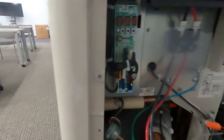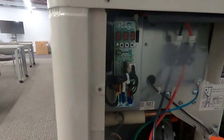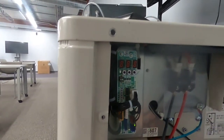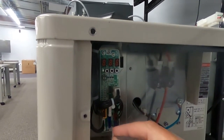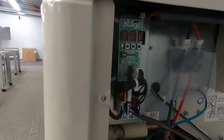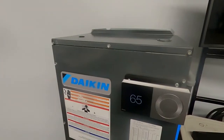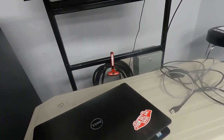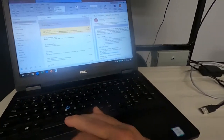I'll splice this video in a bit out of place because I wanted some live video. This is a small-tonnage Fit unit — a DX17, an air conditioning model. You'll see the D-Checker plug is on the little sub-board directly in front, instead of on the large main board. Whenever you're on the small body and have the board underneath the lid, you'll find it on the sub-board.